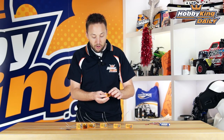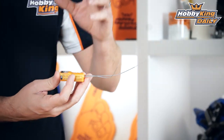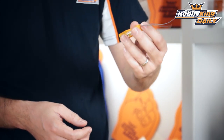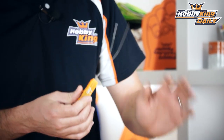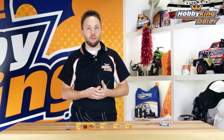Even on the six channel model, this does have dual satellite ports. You've got standard satellite connections, meaning you can have up to two additional satellite receivers on the model. Right out of the box it's going to have true diversity — two antennas on the receiver that are independent, plus the option of adding two satellites. Each satellite receiver also has two independent antennas, true diversity, so you can have a total of up to six antennas. This offers excellent signal diversity — a very robust signal for models with a lot of metal components, such as nitro or gasoline powered models.